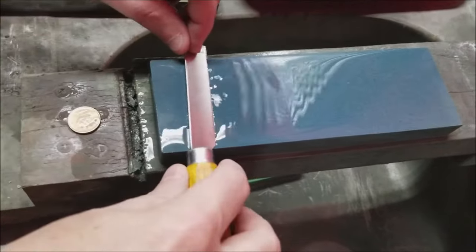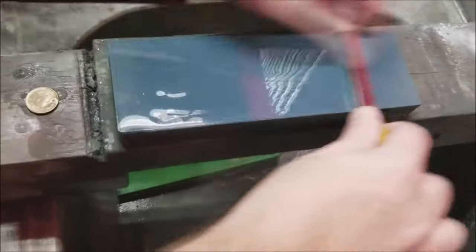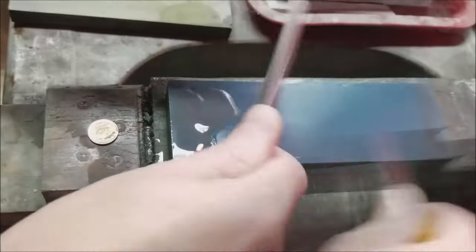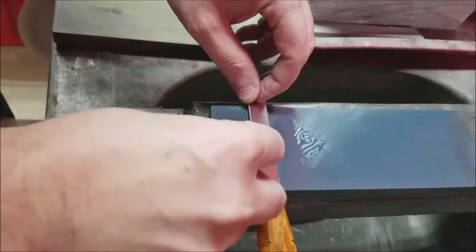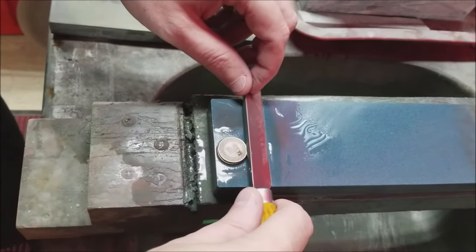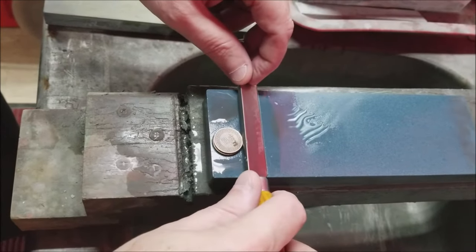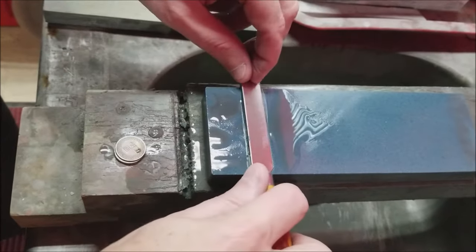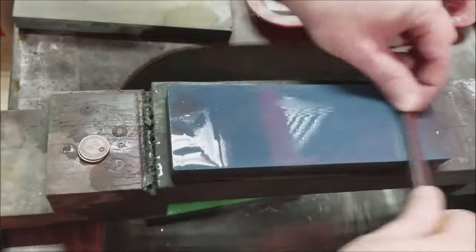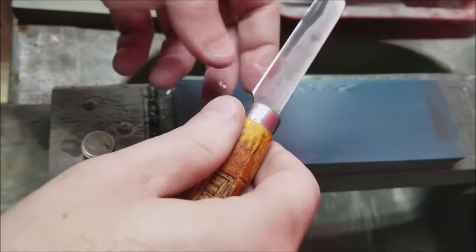So we're going to start with our low angle, forward and backward in a W pattern. And that cleans everything up. You should feel that burr. And then we do the two coins, and this would be the nickel angle, or double the height of the initial. So that's our height there, just for reference, and go from there. So lower angle, higher angle. Okay, burr should definitely be there now. There should be a facet along here as well.